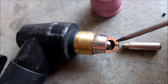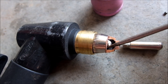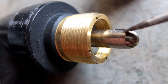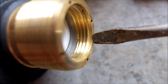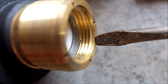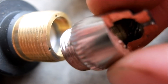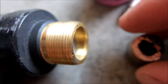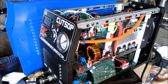Because the gap is way too big, the air is just blowing it out before it can reach and come out. When I was unscrewing this to where it was loose just a tad bit, it'd come down just enough to come out. Currently I'm using this with it slightly loose. There is actually enough space here where the surface can be ground down, allowing the nozzle to go in deeper and making that gap not so big.